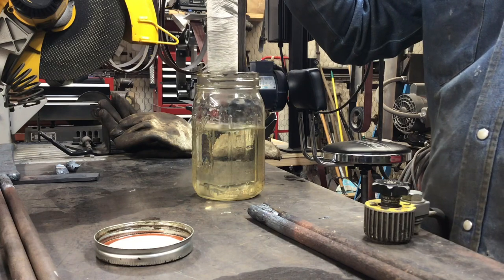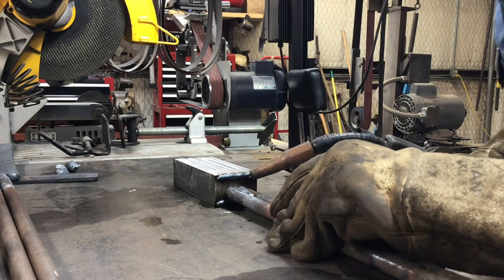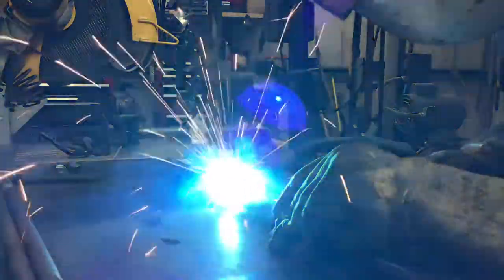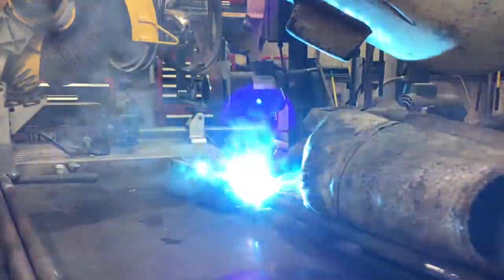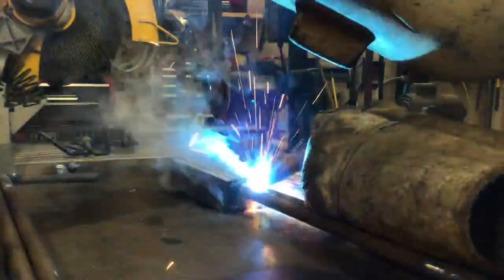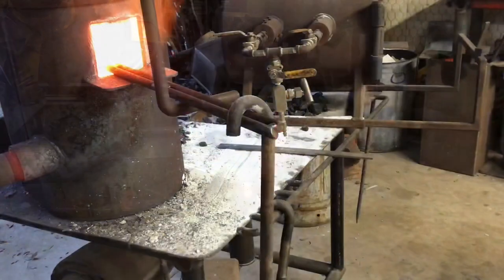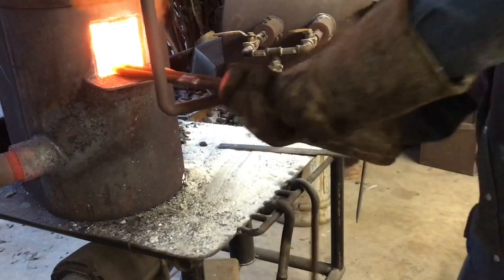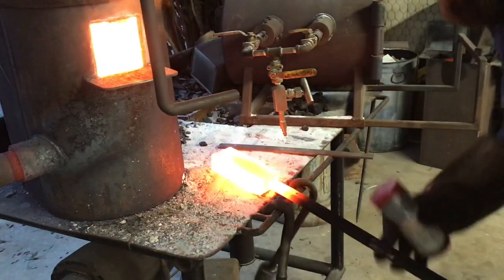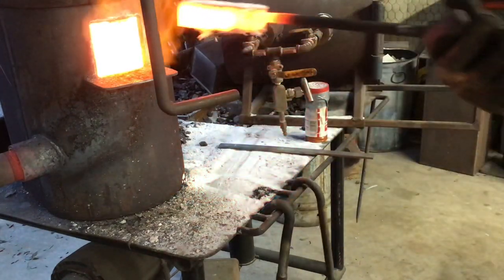As far as welding your billet goes, you want to make sure you've got plenty of weld on there — give yourself a little bit of gap, get some penetration, and stack a nice weld up on there. The worst thing that could happen is for you to be forging and eventually that weld gets thinner as scale falls off and it gets heated up. So put plenty on there. Now that I've got the billet in the forge and it's up to just under welding heat, I go ahead and add some flux to my billet.